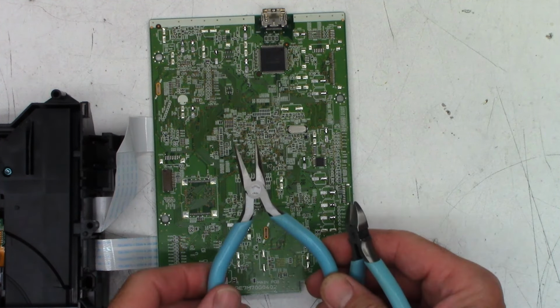One moment. Okay, macro zoom enabled. Here is the optical pickup lens. Walkie-talkie flashlight coming in. Doesn't look too terribly bad. I see a little bit of haze and I see some dust specks. So let's get a regular cotton swab. These are actually Q-tip branded swabs that I use. I find them better than the generic knockoffs. Dipped in glass cleaner and I just kind of flung off the excess.